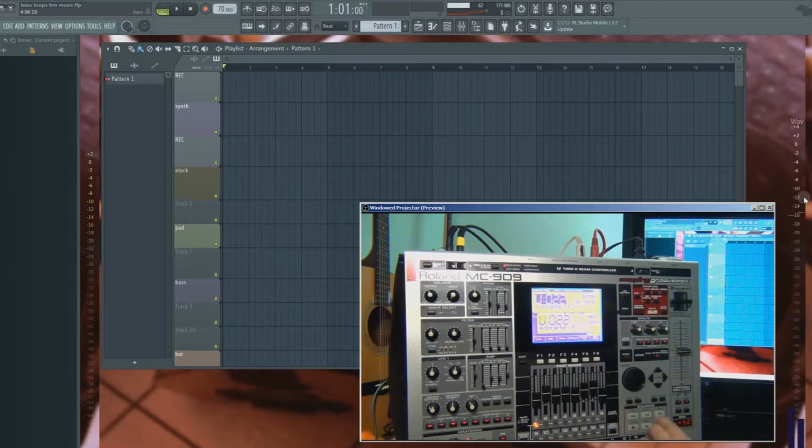Here we go. Okay. So as you can see, it's going minus 10 right here. So that's a good level because you have good gain. Okay, you don't have to bring it all the way up to 0. That's not good. Now the catch is that when you're not running any sound, the level is dialing all the way down to minus 80.